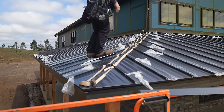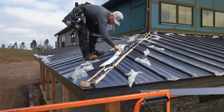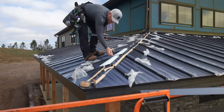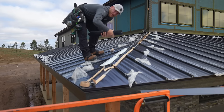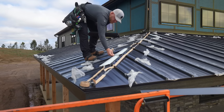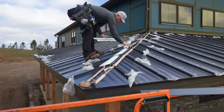Now what I can do is start putting on these — I call them closure strips. Note that I'm starting at the bottom for a reason. Starting on the bottom because I want my overlap to be right here. When I put my ridge cap or hip on, I'm going to be sliding it up the roof. If I go to slide up, I want to be able to see what I'm hitting so I can adjust it. If it's underneath, it might be harder to do that.